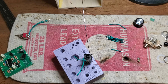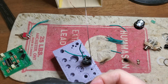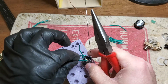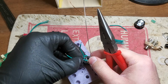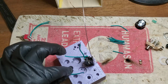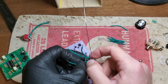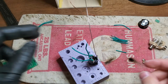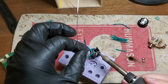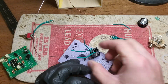Anyways, it was also a matter of compliance, because cadmium is a bit of a no-no chemical in some places, and voltage-controlled light-dependent resistors, LDRs, which are important in the construction of Vactrols, which I was using, rely on cadmium. So because I want my stuff to be future-proof, I want there to be minimal fuss and muss when it comes to potentially exporting these things in the future. I can't be using no cadmium.